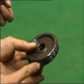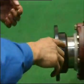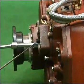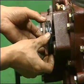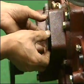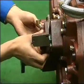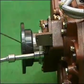Lubricate the cylinder and piston when assembling. Mount the cylinder and fix it with bolts. Mount the piston with the plane end backward and screw down the self-locking nut. Mount the cylinder cover without applying glue and fix it with bolts.